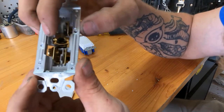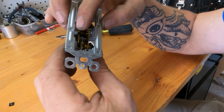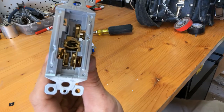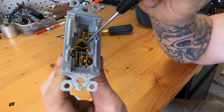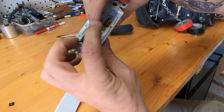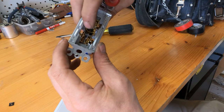Inside of there I've got this little flapper that corresponds to this and it'll actually move the switch into one position or the other. Deep down inside we've got this little flapper that has a tab on it, and it's two positions. Either way, if it's flipped like this, it's going to take this terminal and this terminal and connect the two. Or if you flip the switch in a different direction, it's going to take this tab and this tab and connect the two.